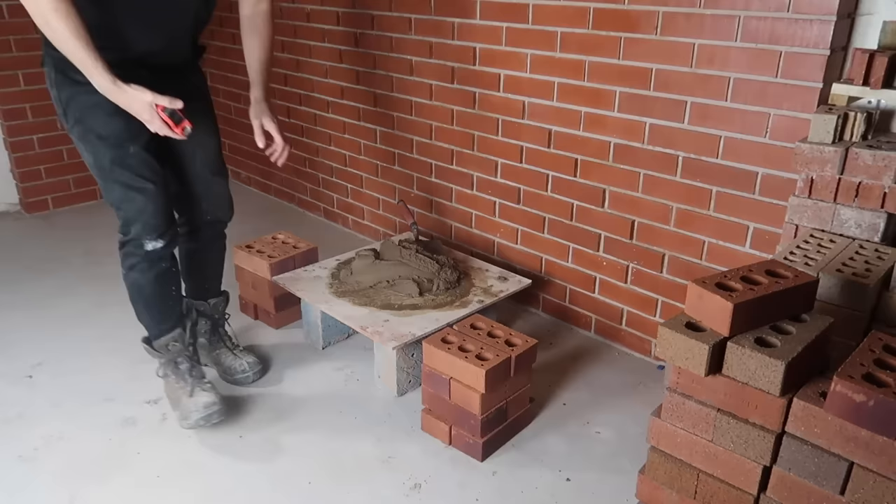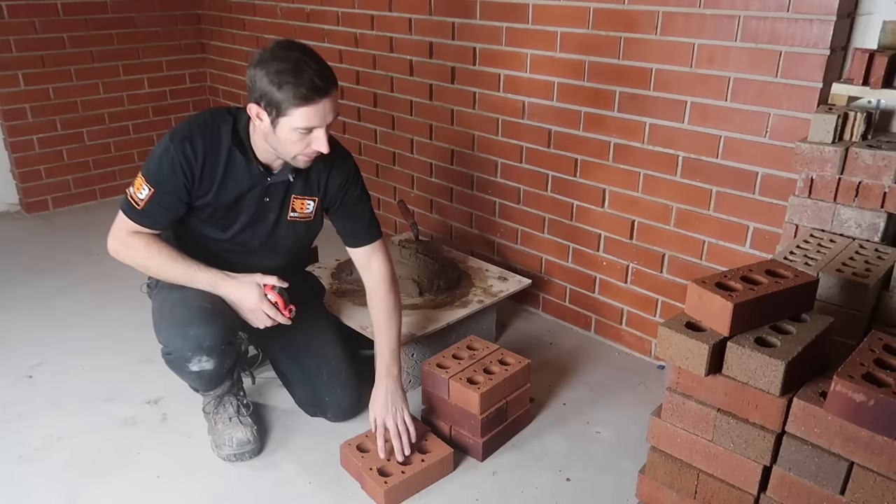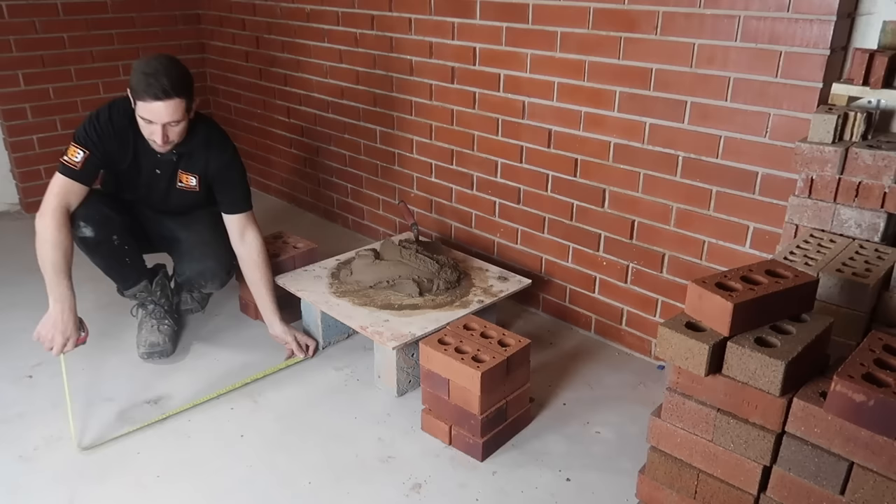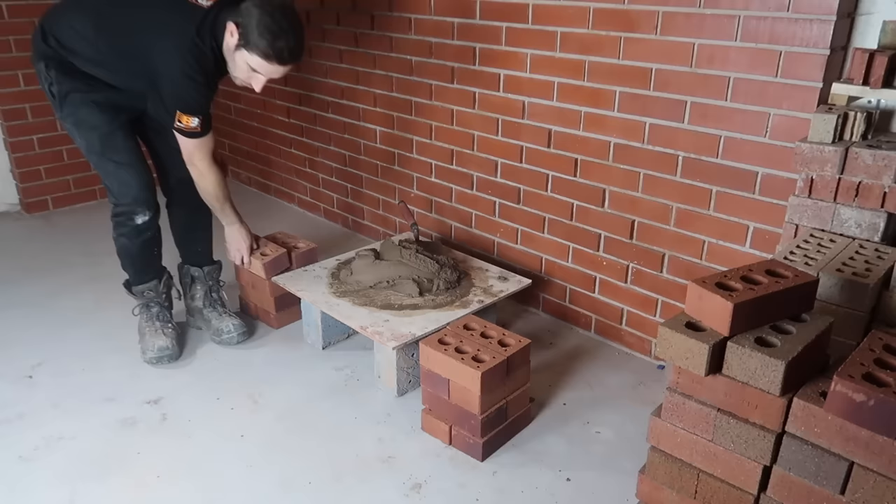And when you're stacking your bricks, you want to alternate them and bond them over each other, like so. So they go like that, and then they bond over that. Your walking space between your wall and your materials should be about two foot, or 600mm. That's about 600mm here. We've already got a previous line here, but we'll just go off that — so just as an example, that's where we'd build our wall.